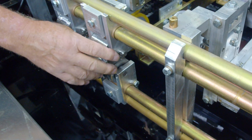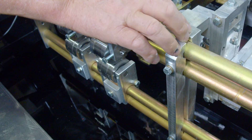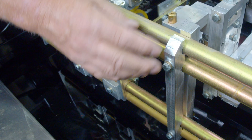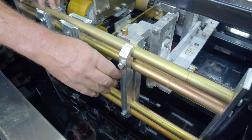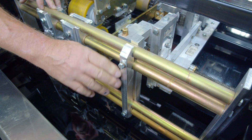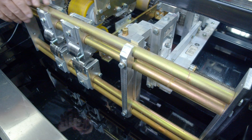After you've set the rib rollers and get everything set right here, your panel's coming through, and this is your stiffener bar to keep the bars from expanding up too far. You want to bring this over right next to your panel, move it back about a half inch to three quarters of an inch, and then tighten it up. That way it doesn't expand too much, and you have a really nice panel.